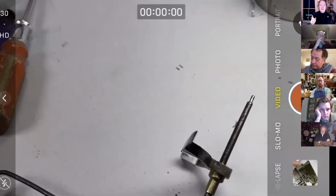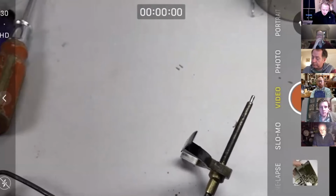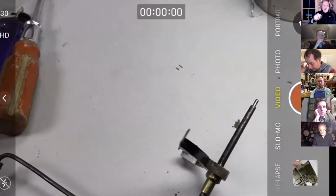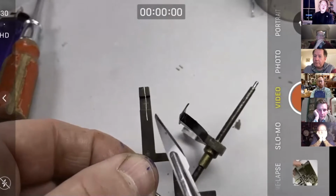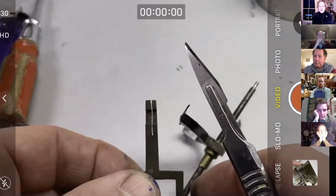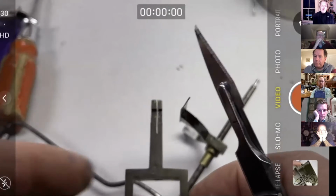The second thing to look at is the crutch. If you imagine the crutch on a long case clock, it should be reasonably parallel, but don't go filing anything off. Often the crutch isn't aligned with the top block of the suspension. So ignore what the clock frame looks like, because the backcock slot, this thing here, is often cut by hand. And in fact, you can just about see here that it's not square with the backcock. Doesn't matter, nobody cares about that.